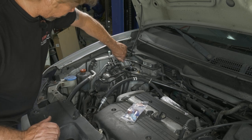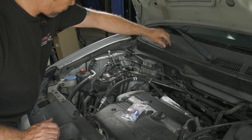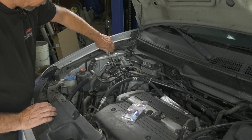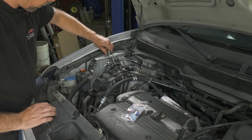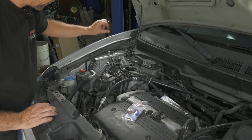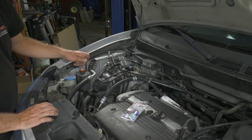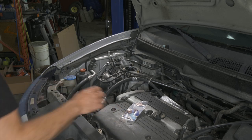We'll go ahead and get the gauges hooked up. Then we have our low side. When I just loosened this cap, I heard a little bit of Freon — I could hear it hiss. So we know we'll probably have a problem in both, but that one is definitely showing more signs than this one. So we're going to go ahead and replace both of those since we have them here in the kit.